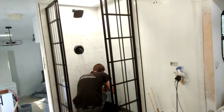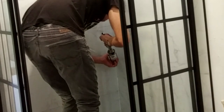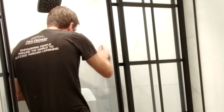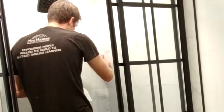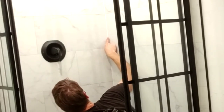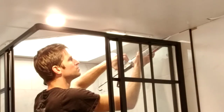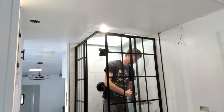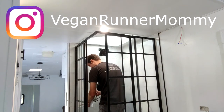The last part of it all is siliconing every seam where water could escape. For this setup I would use white silicone on the walls in the corner and where it meets the ceiling. Anywhere you have a black surface meeting a white surface I would suggest using clear silicone. Make clean lines of silicone moving slowly, because honestly no matter how cool your shower is, if your silicone looks like junk your shower will look like junk. Have some pride and don't forget to silicone the outside of the seams of your wall and door profiles as well. And naturally, don't accidentally silicone your slider doors to your door profile.